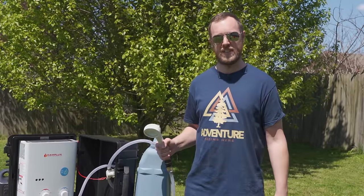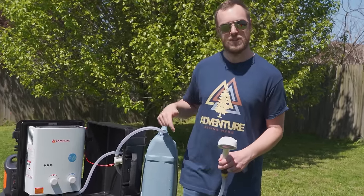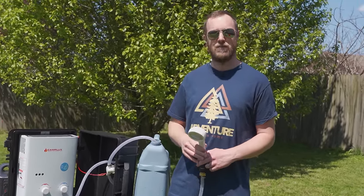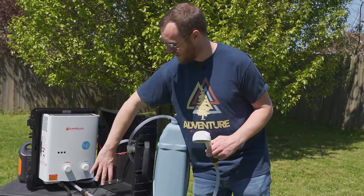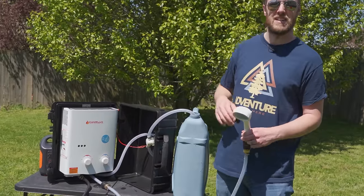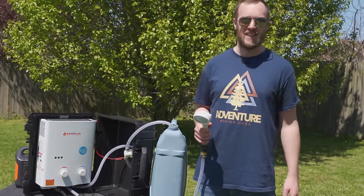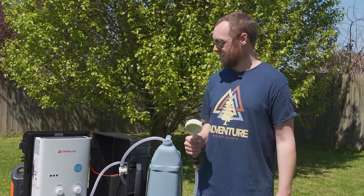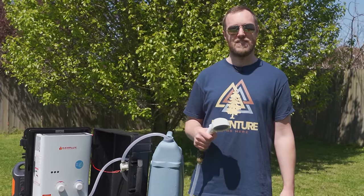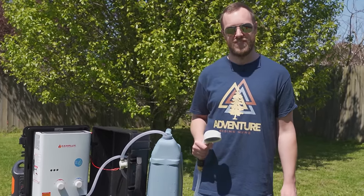A tip: especially if you've got a jerry can with the output at the bottom, hook all of this up to it so water comes out the bottom and use this hose to feed it back in the top — you can actually preheat your water. It will use a little bit of gas, but at least you'll have a consistently hot shower. If you're interested in building this yourself, make sure you use the links in the description or at revereoverland.com/shower so you can guarantee all the parts fit and avoid the trial and error I went through with the elbows. It'll make your life a lot easier and I get a small commission from Amazon at no extra cost to you. If you found the video useful, give it a thumbs up and subscribe. Thanks for watching.